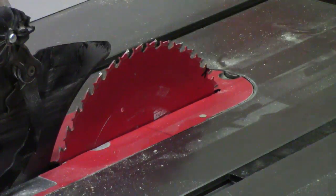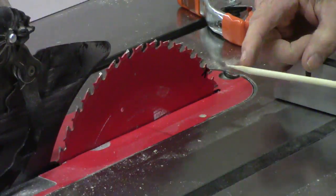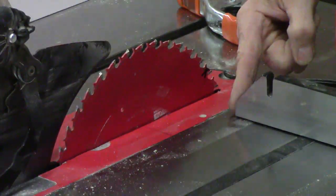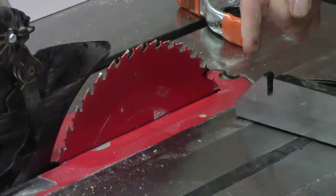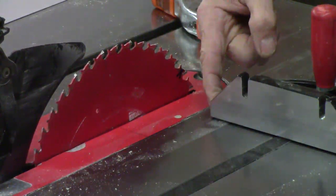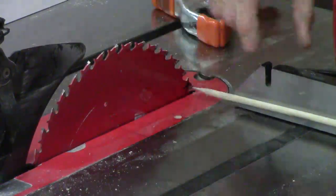A spring clamp is an okay choice for this, but not a great choice. I think you'll see why in just a second. And this is my high-tech gauging device, a 1/4 inch dowel. I just put it in the pencil sharpener and put a really sharp end on it, so we can get a real distinct read point here. Now, one of the things to pay attention to is that your miter gauge has a little left and right wiggle. That's okay. When I do this test, knowing it's got a little of that, I'm going to push it to the left, and I'm always going to hold it to the left throughout this test. The way we do this is use that X. Are you in tight on this, Kristen? Thank you.